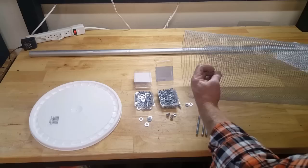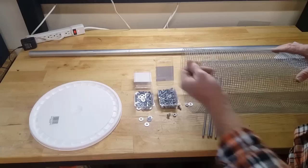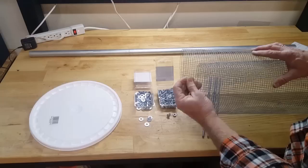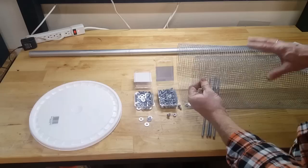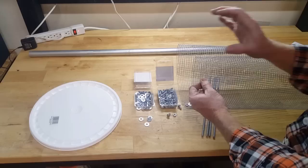The main part of the screen is this mesh screen — this is quarter-inch. The reason I choose quarter-inch versus half-inch is several reasons. First, when you build your trommel, you don't want any slop. What I like about this is that I can actually take these quarter-inch bolts and slip them in here, making it real easy for drilling and mounting — so there's no slop. If you go with half-inch, the squares are larger, so you'd need a larger washer, you're into the fender washer situation, and you're going to have a lot of slop and not a very rigid system.